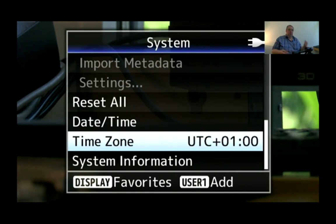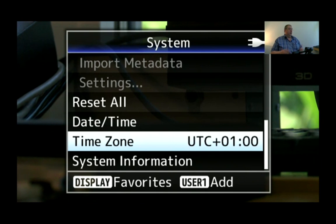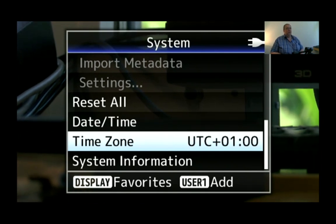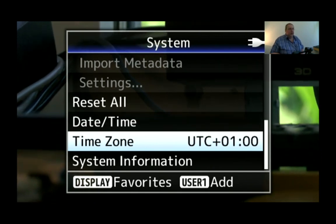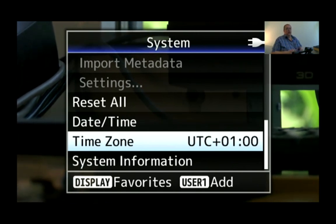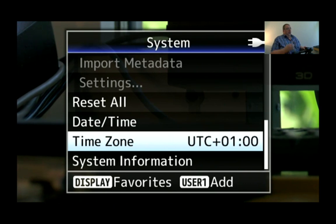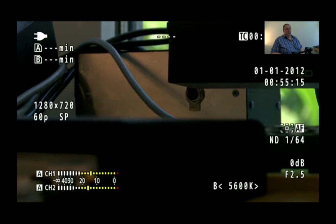Well, if you want to do live streaming, it has the capability for 720p, 25p or 30p or 1080i. So there is no 50p or 60p. So your whole system, of course, needs to be changed then to a standard resolution at 50i or 720p 50. So that gives you, I think, a really big benefit. You get an excellent camera option to record in 50 and 60p.